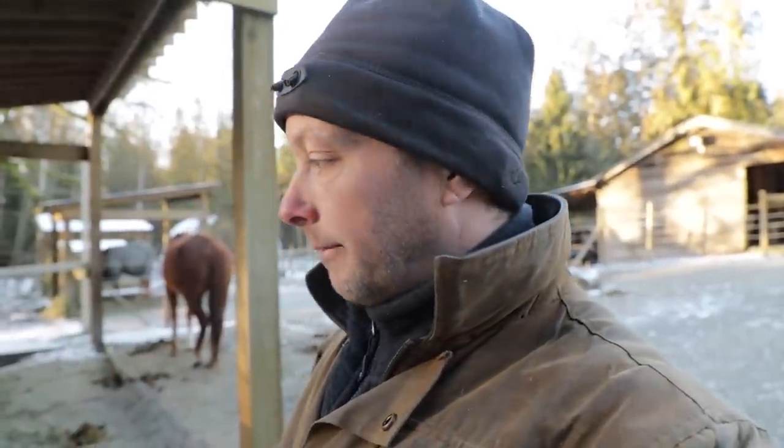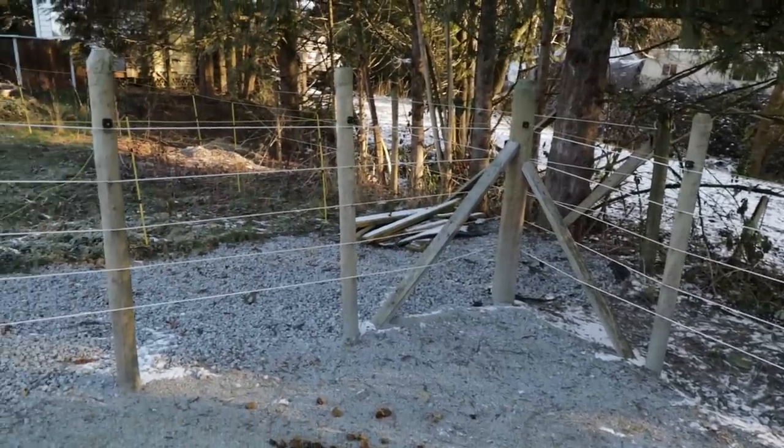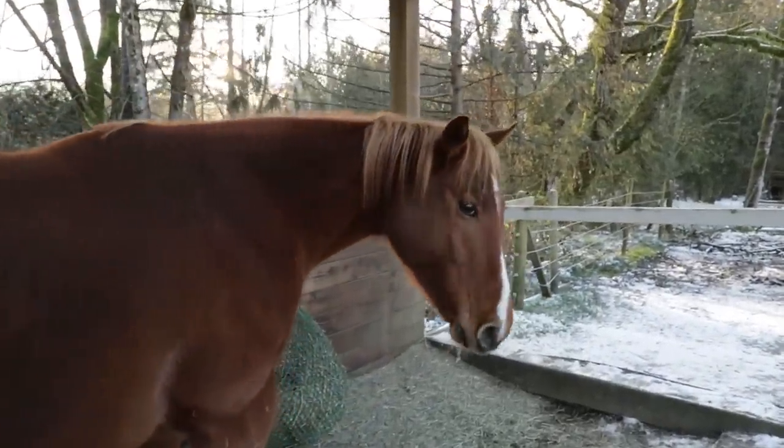It's about figuring out how tight you can put it. In the far paddock the corner post didn't have very good ground — it was too fresh — so I've got some cargo straps going back behind the paddock to some trees to help tension that post. With enough tension on all five wires, especially the top wire, you have enough leverage to bring a post in, so be careful of that. But overall it's a very economical, good-looking, easy-to-install fence. It comes on a big spool of about 2,500 feet, so you can get a lot done, and it's good for the horses.